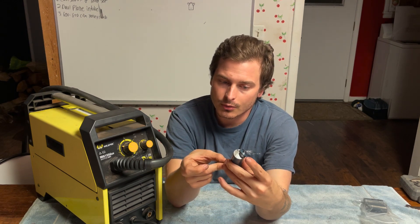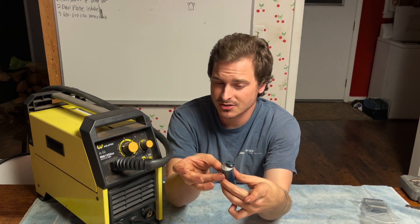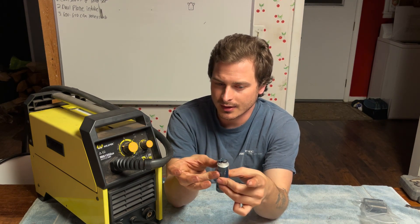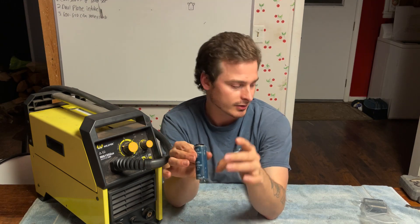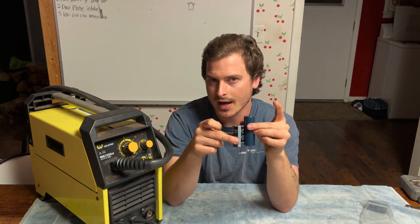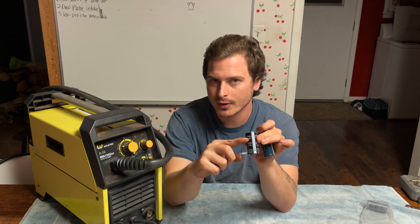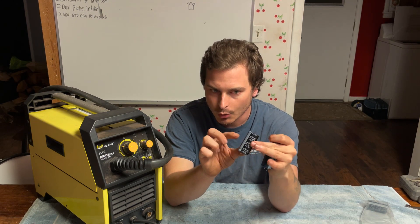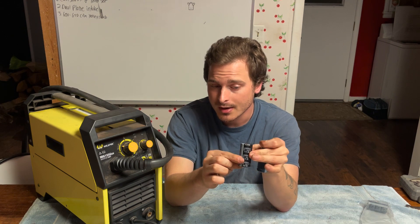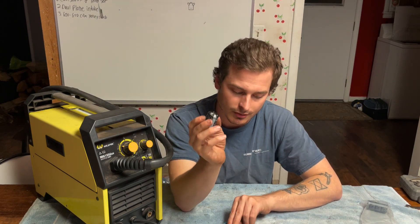You can also upgrade it. This one has an 85 degree Celsius temperature range, but you can get a 105 degree Celsius temperature range — that just means it has a higher rating. The higher the number on the temperature, the higher the rating. When I bought mine, you can see the height is different but the diameter is the same. The microfarad rating is the same, the voltage rating is the same, but the temperature rating is higher — 105 degrees Celsius. So I know it's good because the diameter is going to fit in there.